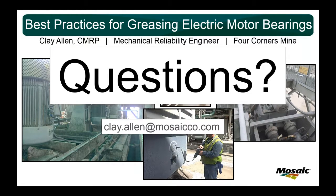I just pulled everybody in a room. I put together a little presentation. I had the gun so that everybody could practice pushing the buttons and listening to the sensor and everything. Kind of had a little kickoff meeting. Had the procedures, gave them the procedures, and what ended up coming out of that is I would walk around with them probably about half of the route, make sure they understand what buttons to push and help them get adjusted to listening to the sounds of the bearings and understanding exactly what each sound is telling you, what lack of lubrication sounds like, what contamination sounds like, and how much of a probability you have of making that sound good again, and kind of explaining what the dB means.